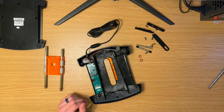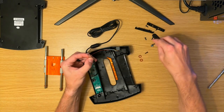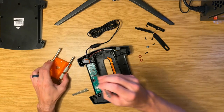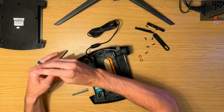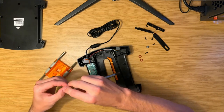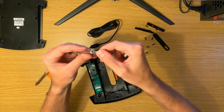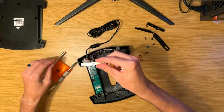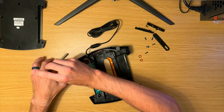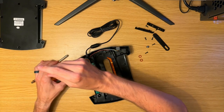We'll go ahead and install our leaf spring friction adjustment from the old slider onto the new one. You can go ahead and use the screw that comes with the slider for that — I always include an M3 screw and nut for the slider that works perfectly with this. You'll notice on the old slider there was some felt on the leading edge of the slider to help eliminate rattle of the leaf springs against the slider itself. I've accommodated that via just tight tolerances, so you'll notice that this rubs just a little bit on the front edge — that's by design. It does not in any way impede the friction adjustability of this part.